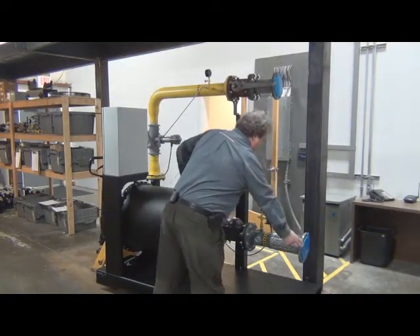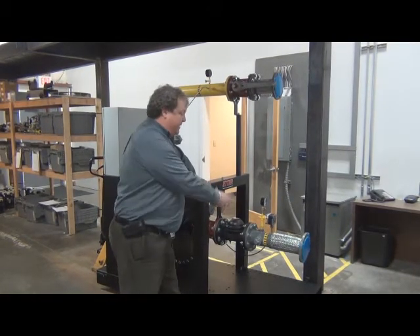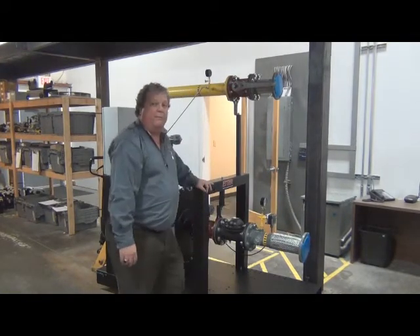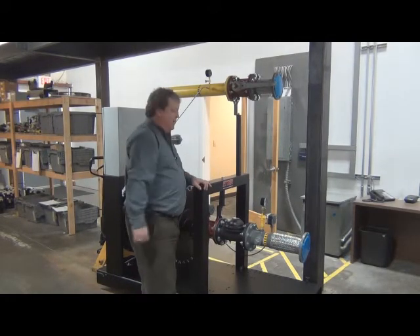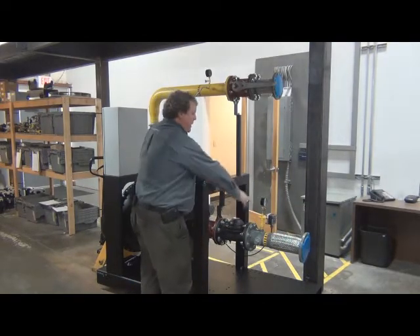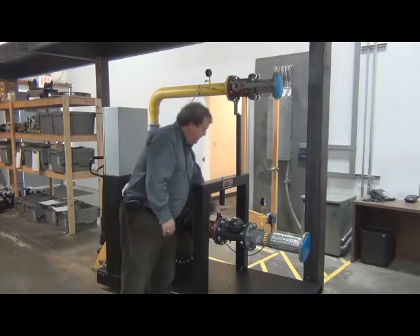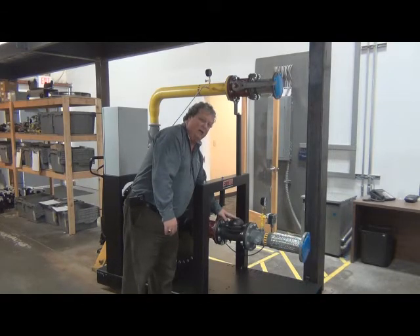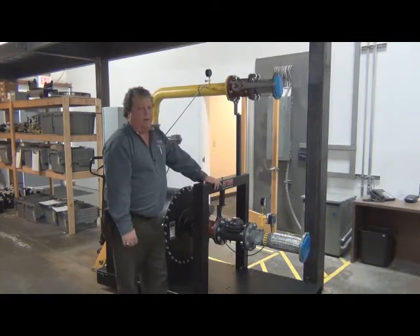This is where the gas is going to come in — your inlet flange that the house piping will be connected to. We have a stainless steel overbraid flex hose that's going to isolate the skid piping from a vibration standpoint. We have your low gas pressure switch, manual reset, that protects the gas company's header pressure — notice it's pre-wired to the control panel. And an inlet pressure gauge to monitor what street pressure we're getting from the gas utility.